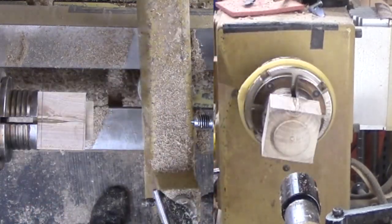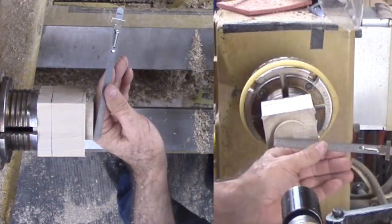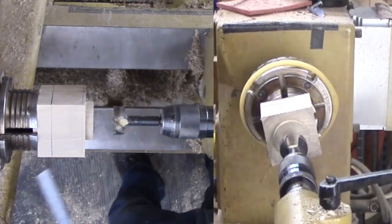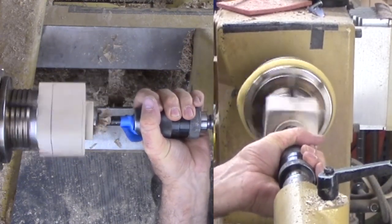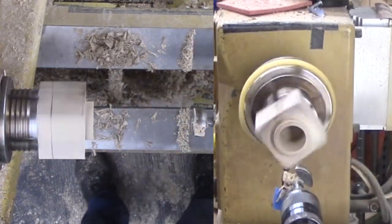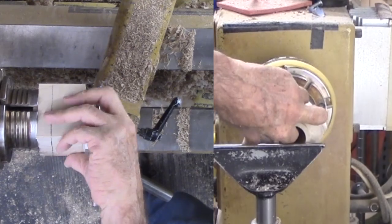Now for some critical measurements and markings — I had a lot of freedom before this point. Now since the target is a cube and the top is locked in, I can measure and mark for the bottom. For the interior hollow, I subtract another quarter inch, then drill for the interior hollow with a Forstner bit. Unfortunately, I did not allow enough for the point of the bit, so I will have to leave it in the bottom. With a box scraper, I enlarge the hollow and reduce the wall thickness. I am also able to trim a little more from the bottom, but not enough to eliminate that point mark.